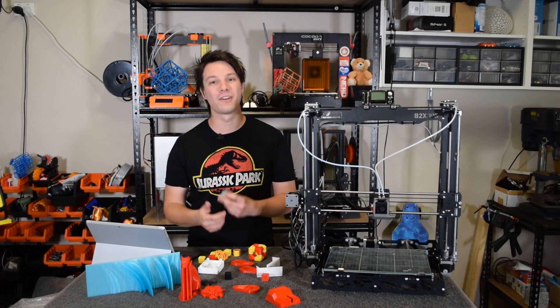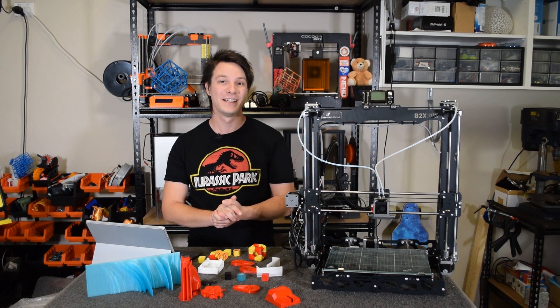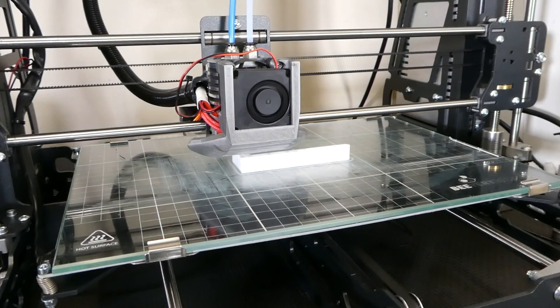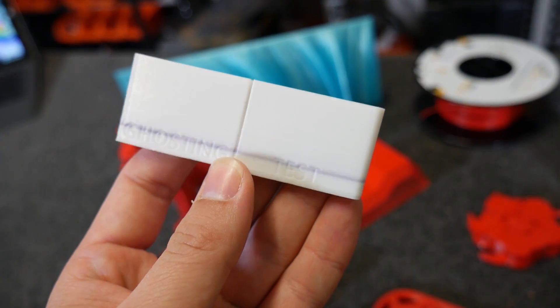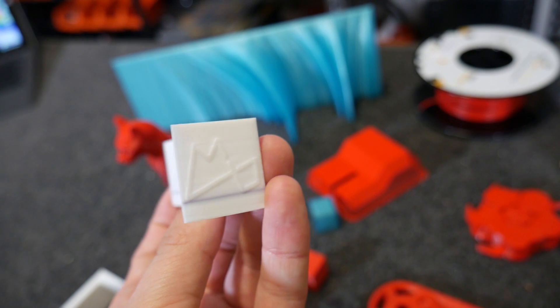I had no idea what was going on, and honestly it was maddening not knowing exactly what was happening. In desperation, I actually moved one of the extruders down closer with a shorter PTFE tube, and it actually worked really well. This is a ghosting test, and the black lines are just me using a marker to see extrusion rates, but it printed great.